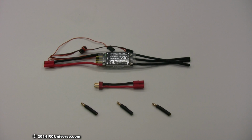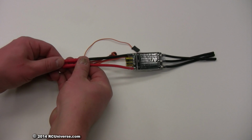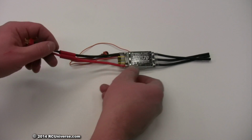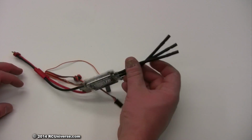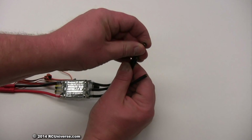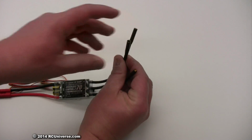The Graupner ESC arrives with pre-installed battery and motor connectors, so I fabricated adapters for a hassle-free installation. The Cadet's motor has 4mm connectors, while the ESC has 3mm connectors. I made adapters by soldering together a 3mm male and a 4mm female connector and covered them with heat shrink tubing. The battery I plan to use has a T connector on it, so I made an adapter from old battery parts I have saved. These pieces made installation a breeze and took about 30 minutes to make.